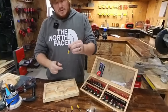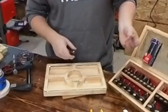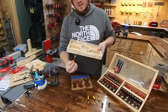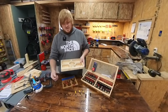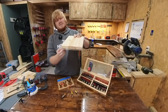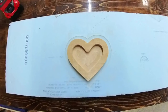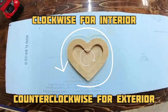Some bearings are on the bottom and some are on the top — both have their advantages and disadvantages. If you're using a bearing on the bottom, it's more than likely going to be to remove material inside of a project template like these cutouts. If you're using a bearing on the outside, it could be in the tabletop setting that will guide against the outside to remove all material. When routing, remember to go the correct direction: counterclockwise around the exterior and clockwise around the interior.